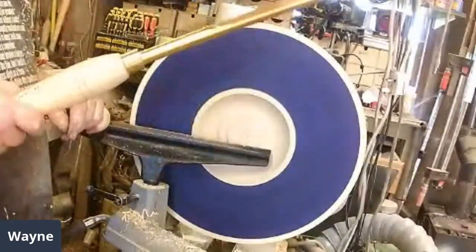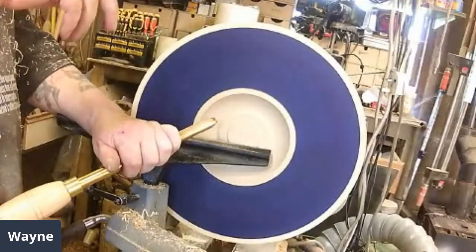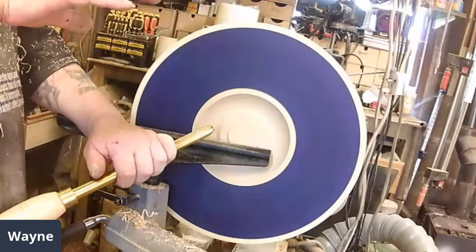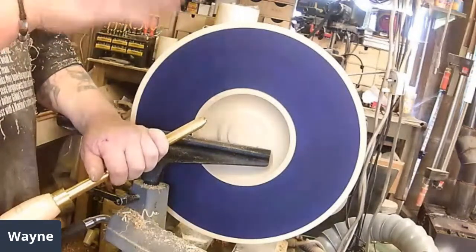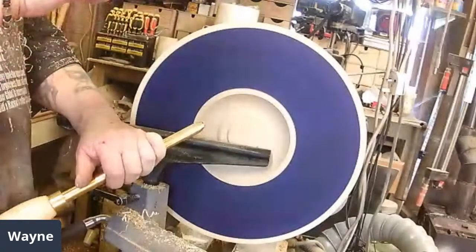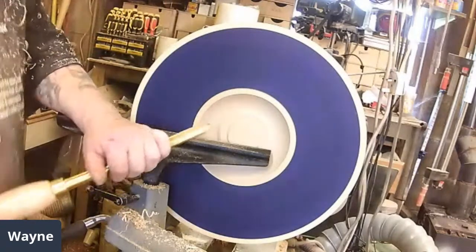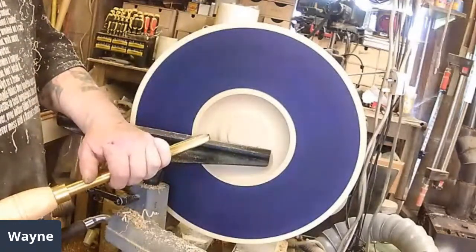The next piece of wood that I'm going to process is a piece of ash. It's 52 inches long by about 16 wide and 4 inches deep. It has got part of the pith running through it, so I am going to have to process it. But I'm going to get 2, 4, 6, 8, 12 by 2 platter blanks out of that, and a 52-inch length of 4x4 to use for spindle work. That's 2 cubic foot of ash, and it cost me 70 quid.